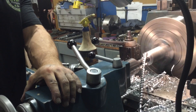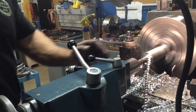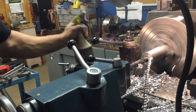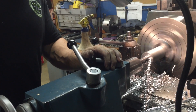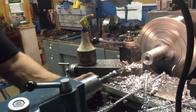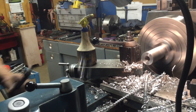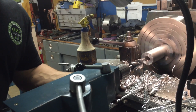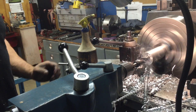This will get a little more entertaining here in a little bit, once you see my job shop tapping operation. Finishing up the drilling operation, spray a little coolant on there, pull the drill out a few times to get the extra chips out that are building up in there so we don't pack that up and snap the drill bit. We've also skipped some of the boring operations, like dialing in the center for these parts every time in the four-jaw chuck. Now we're going to drop in the final drill — this is 1 and 11/64 inches, which will be the perfect size for the tapping operation.